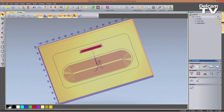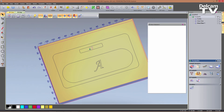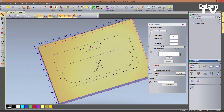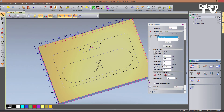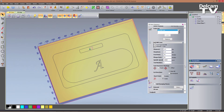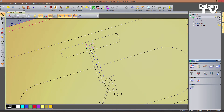If I close the form down and again make all of my toolpaths invisible, I can now machine this small slot. Again, area clearance. This time the start depth is going to be 15 mm — I don't want to waste any moves, and I know I've already cut 15 mm deep — but the finish depth is going to be 30 because I want to cut all the way down to the bottom of my part. My tool, as I said, is going to be my 6 mm end mill, and again I want to change the strategy type to be offset. You can click on calculate, and the toolpath will calculate as you can see.